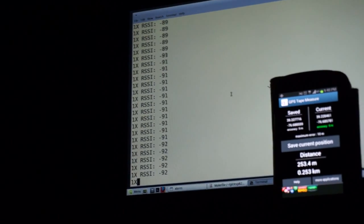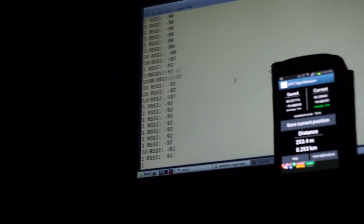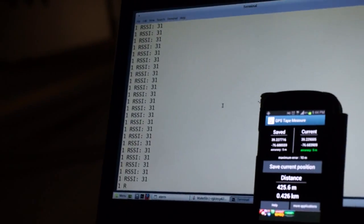For the ESP12E, we're only at 250 meters here and already we're starting to get some trouble. I guess we'll just keep on going, seeing how good it is. So at least my first impression is it might actually not be as good — maybe there is something to this whole RF design thing. I got a couple of packets here at 425 — it just dropped out. I think this one's 425 is about its limit.